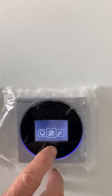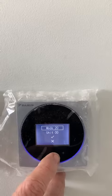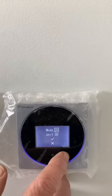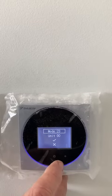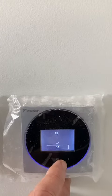Until you get to the menu symbol, enter. We want to go up to 23 to do this for the static pressure. So enter, plus, plus, plus — we get to 23, enter. Come down and accept it. Wait for it to populate.